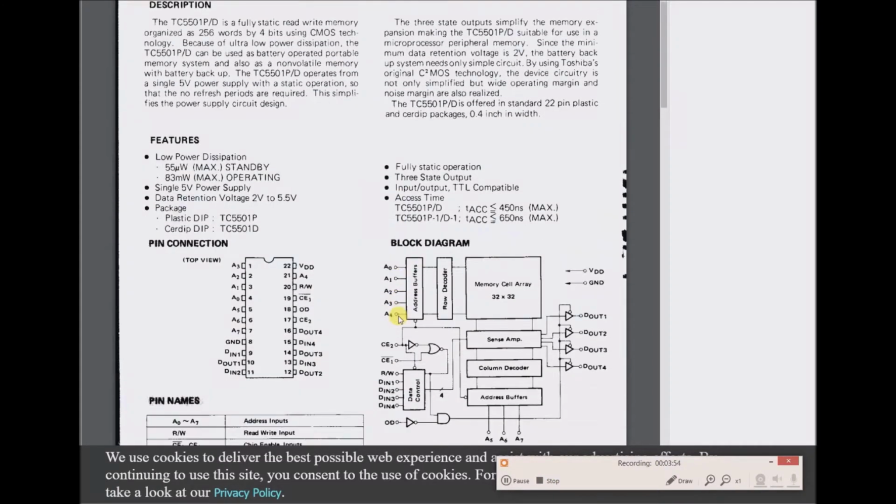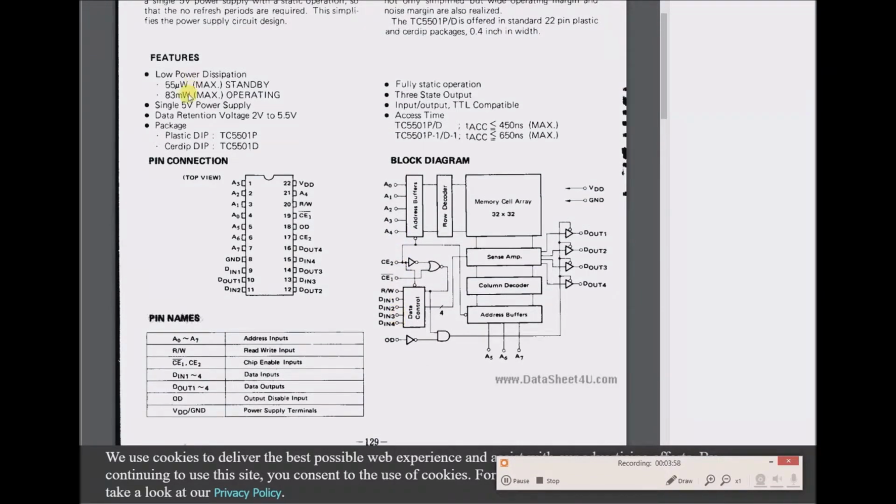So here are the features. Low power dissipation, 55 microwatts standby, 83 microwatts operating, or milliwatts operating, single 5-volt power supply, data retention. I already read that in the description. It's got, well, 11 pins on this side, and I guess 22 pins on the other side. These A0 to A7 are marked as address inputs. I guess this is a read-write pin. Pin 8 is the ground. There's inputs and outputs. How does this all work? I'm not going to pretend like I completely understand it.